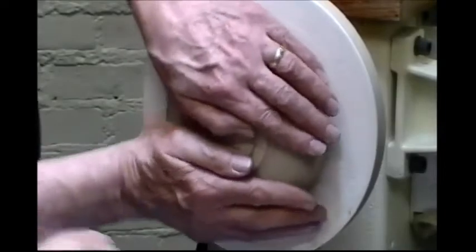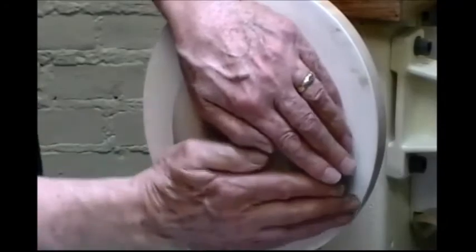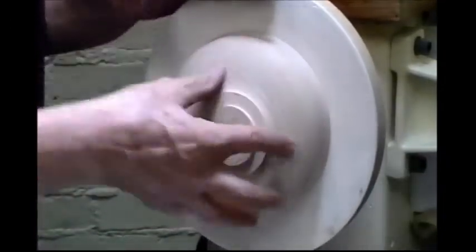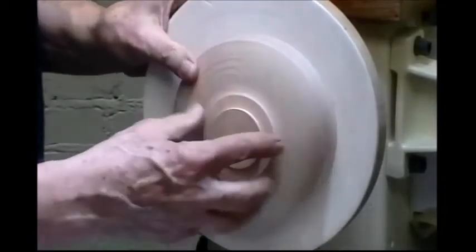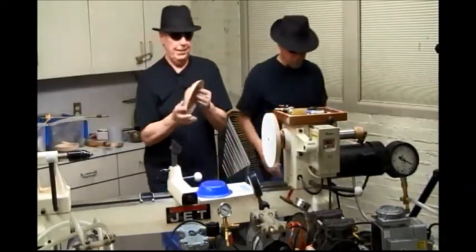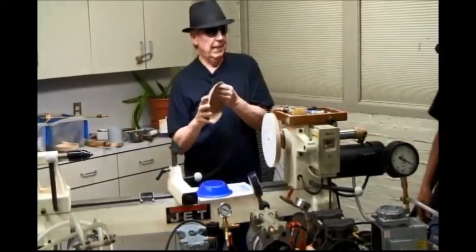If I could find the leakage spots and put tape over it, is that gauge moving at all? No. This thing is so leaky. This is the porous wood I was talking about earlier. Unless you have enough volume in your pump, you don't want to turn this kind of wood unless you want to put a seal coat on here.